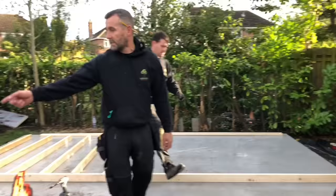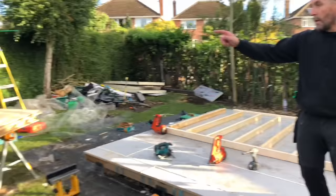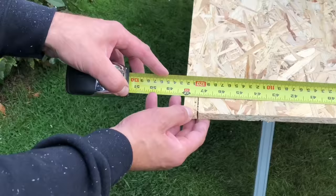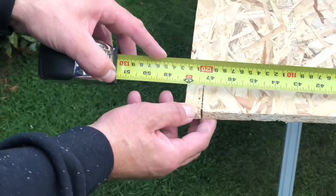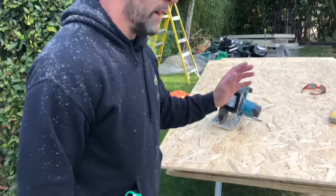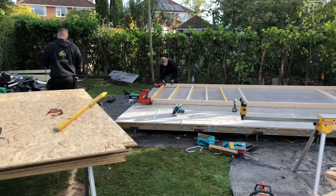They're the timbers for the uprights. We've already cut, they're pre-cut. The boards over there, they are old imperial size boards, which they all tend to be. So they're 4 foot, whereas your plasterboard's 1.2. So what I'm going to do, I'm going to rip a piece off all the boards to create the 1.2 board. What I'll do with them as well, I will mark up the boards for the 400 centres. So when they put the board on the top, they'll be able to see where they can nail.